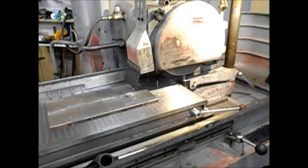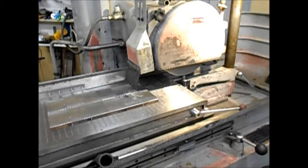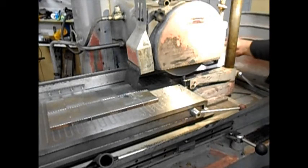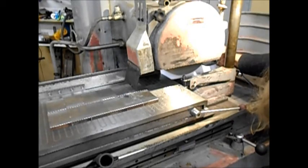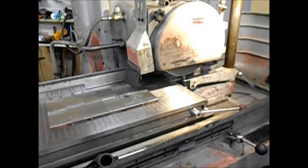When touching off, I've found you don't want any coolant — coolant is about the worst thing you can have. Another trick is to put something white, a white piece of paper, behind the wheel. That way you can see exactly how much space you've got. Once you're past the point of being able to see, use your fine downfeed, or just take it nice and slowly until you hear the sound of it touching.